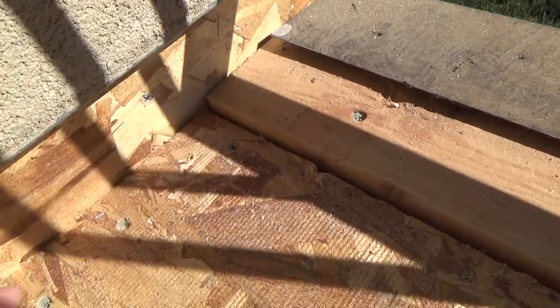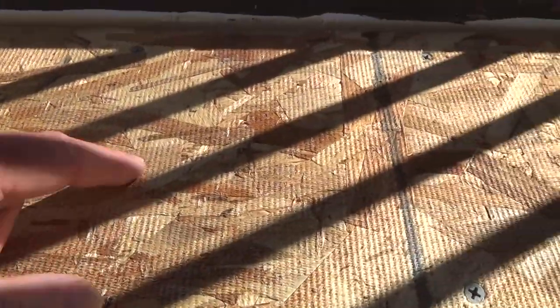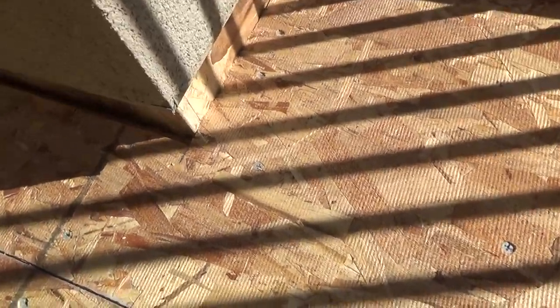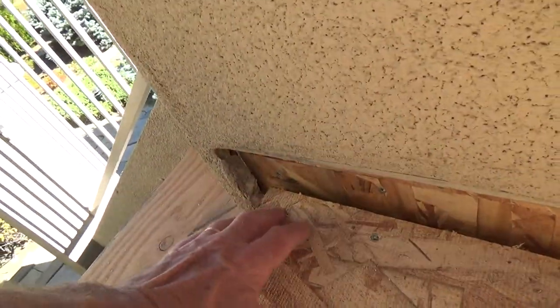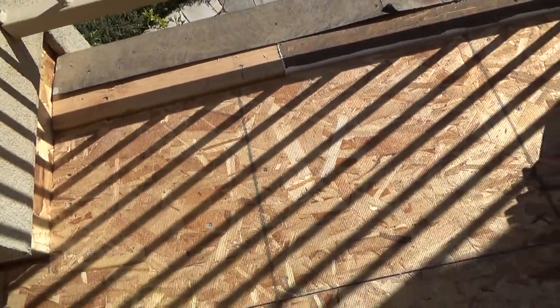If I float this from this point on down, I'm gonna have to go from here to where my low spot is over here. When the water comes down it's gonna hit right in here, and I'm going to encourage the water to flow this way before it flows out. I don't want it to get close to the column. I raised this edge and this slopes downhill, so when the water comes from here it's gonna go this way and then trickle on down before it goes out.